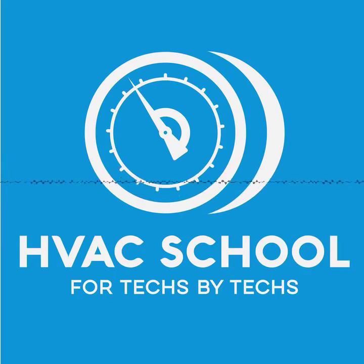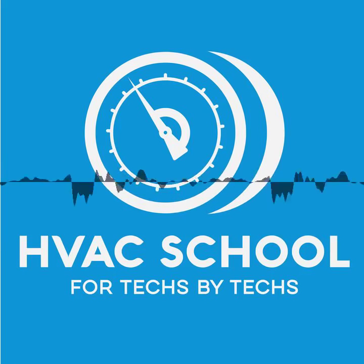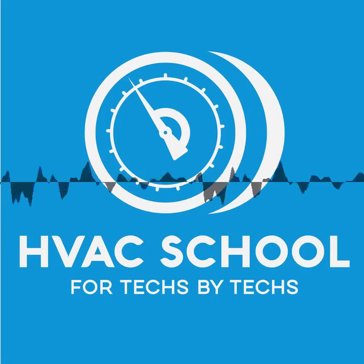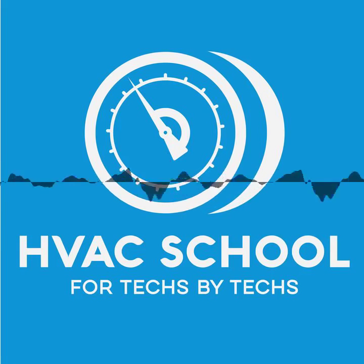They're doing a refresh on the TechLink app, tying in the Redfish IDVM 550 meter — a power quality analyzer. They're particularly interested in the 550 for the power measurement side because they do a lot in MeasureQuick with measuring EER or SEER. The new 550 measures voltage, amperage, and power factor so they can get true power. It has very good low-end resolution, going down to about three watts — really useful for SEER or EER of an AC system, as well as fan watt draw for CFM per watt consumed.